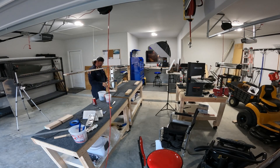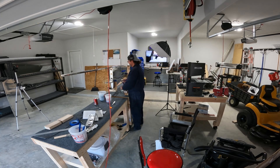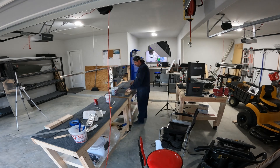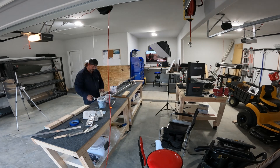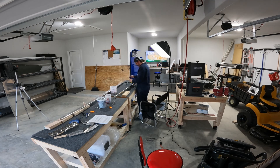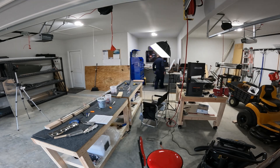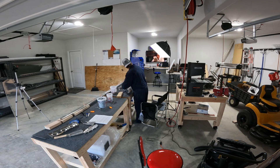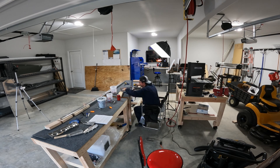What we're looking at here is the horizontal stabilizer — the left side — that I'm currently disassembling. Things are a little out of sequence because I had replacement parts that had to come in, so it all had to be fit back together so those ribs could be fitted. The two inboard ribs — the fore and aft rib — don't come with any holes along the flanges, so they need to be match drilled to the skin and also where they meet the forward spar. Holes need to be created there, as well as cutting out part of that forward rib's rear flange to get it to fit around the splice angles.